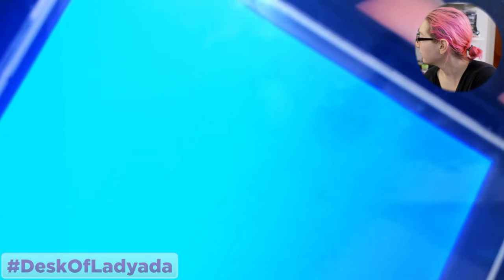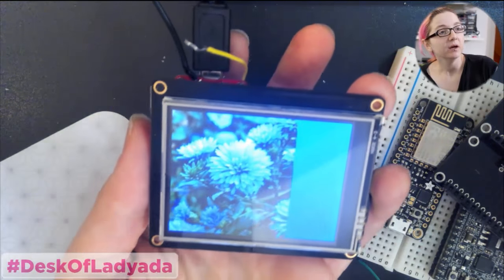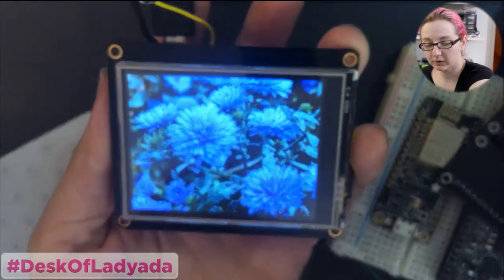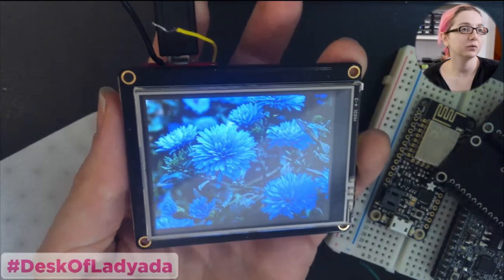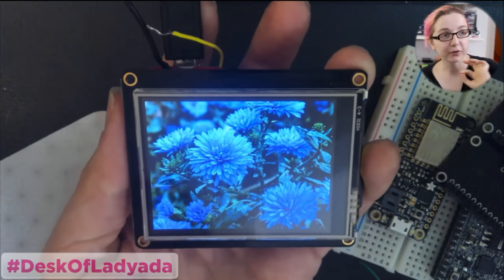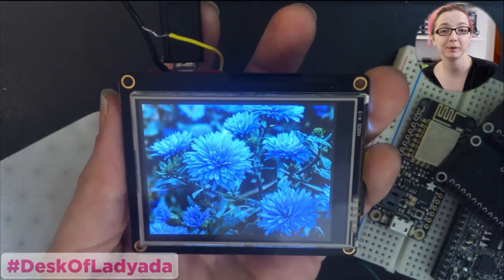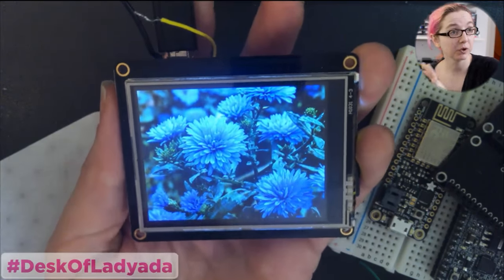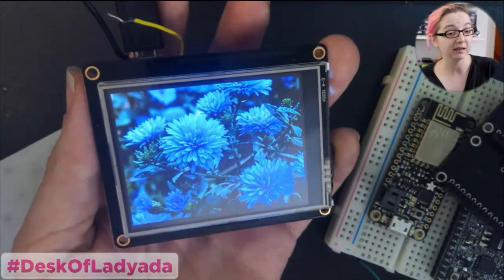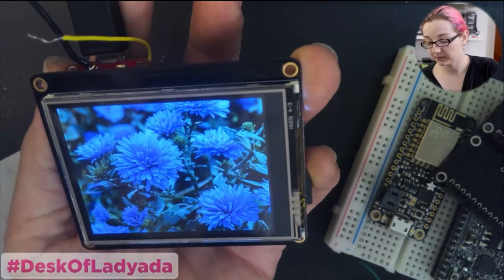So the only thing about SPI right now is that it's a little slow. Look at that. It's much slower because from what I can tell, there's a real-time operating system running on the back of the Arduino IDE API, and it requires a mutex lock whenever it does an SPI transaction. So every byte right now takes 30 microseconds. Instead of being 32 megahertz, which is what it's supposed to be clocked at, it's essentially being clocked at 250 kilohertz. So it's quite slow, but it does work. You can always optimize it. I basically just took the SD library and set the defines up so it would work, but I haven't truly optimized it so that the transactions occur in large chunks. So that's the next step that needs to be done.